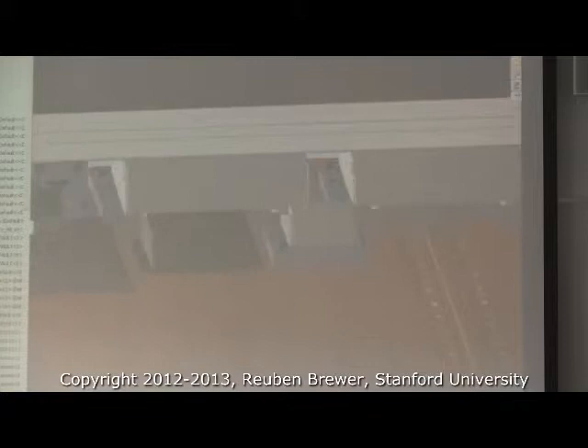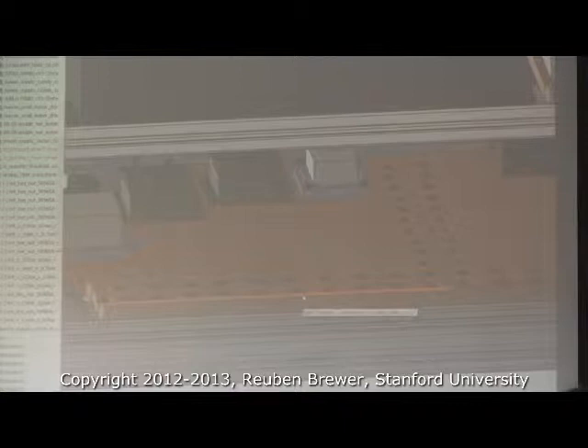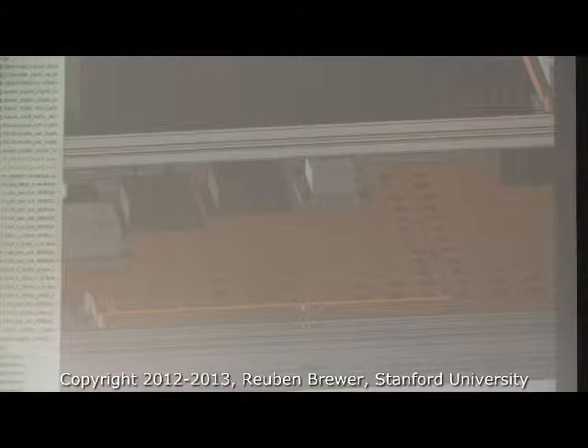The other thing I want to note: you see this MDF here? What does that remind you of from last week? The optical table. Optical tables are pretty expensive and heavy, so I chose to make the expensive and heavy part the 80-20, not the optical table. What you can do is laser cut yourself your own optical table out of MDF. This is really great for bolting down electronics, because it's hard to know until the robot's actually built where all the electronics go — but with an MDF optical breadboard you can just move things around as you want.